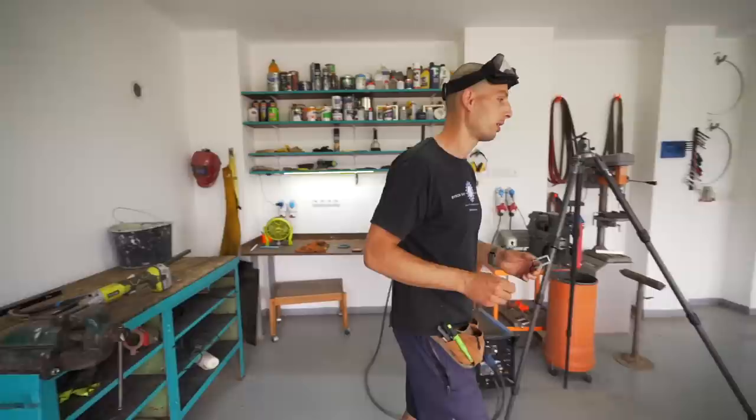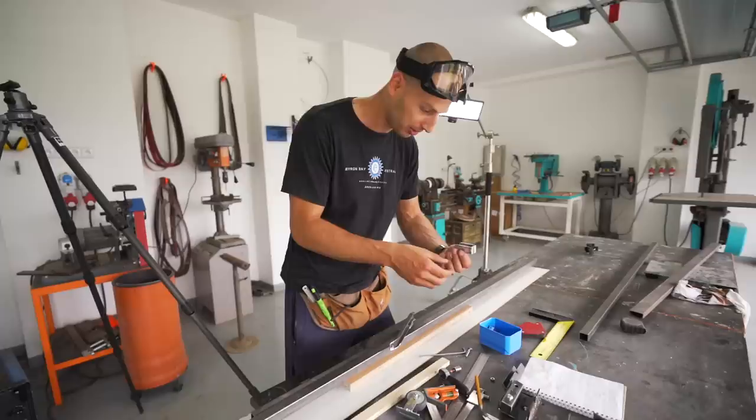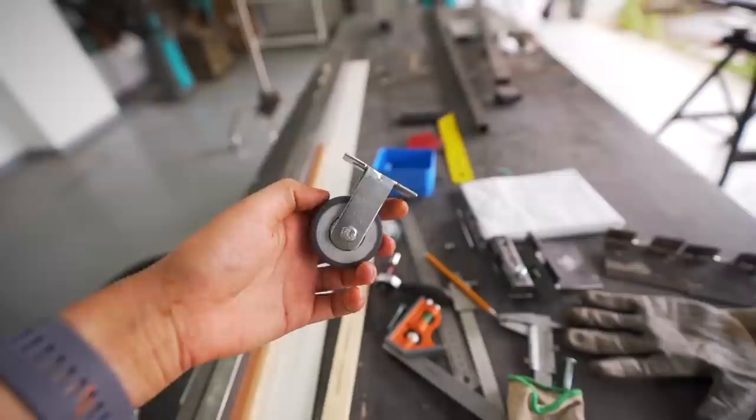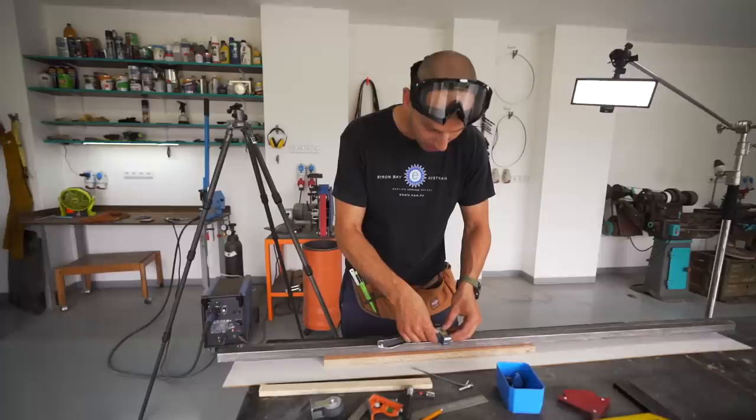This is so heavily customized since the original client. I cut all the sides that are supposed to be screwed to the trolley or whatever it's on. And now look at that. See the unnecessary height right here? I need to shrink the two, so cut it, move it in there and weld it again, so I can have this low profile solar panel. Because look, all of that actually matters right there.